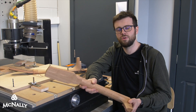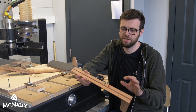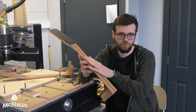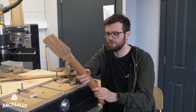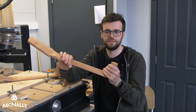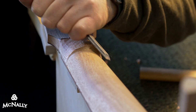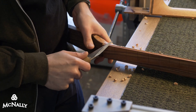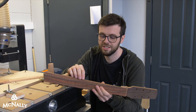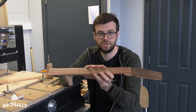What I also use this machine for is doing the bulk machining on my necks. You can see here — this is actually a reject neck, it has a few pinholes — but it does this first face which accepts the truss rod and has location holes for the fretboard. It gets rid of about 80% of the wood that just isn't going to be used. I'm leaving that other 20% that I'll still do by hand — I'll still final shape the neck. Here's a neck that's been assembled; you can see it's still heavy on all the edges, the volute still hasn't been carved.